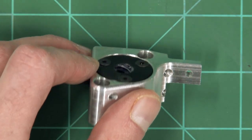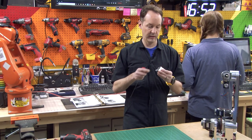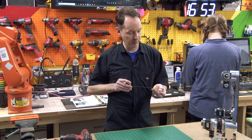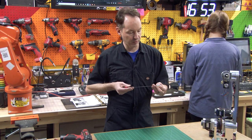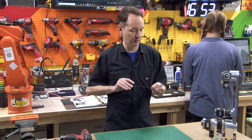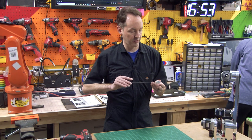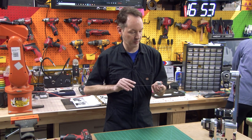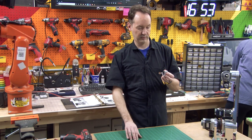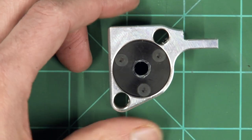Could they be a little bit more countersunk? Yes. I might actually, I don't know. I think they're good. If we have any issues, then I'll bring them in a little. I'm kind of hesitant to just super sink them right down in there. You can countersink them below the surface, and I don't want to do that. I want them to be just right there. Cause they're easily within 15 thou, so I'm calling it good.